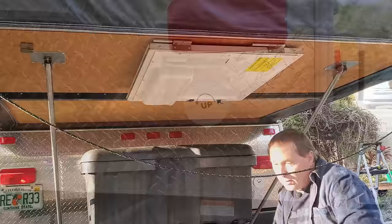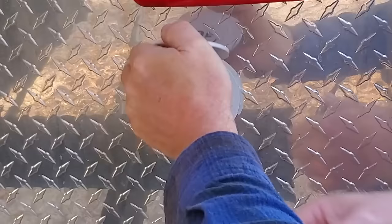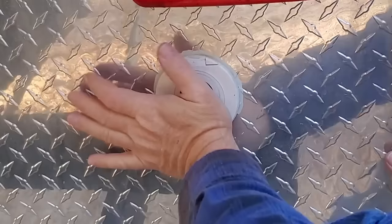So one other thing I wanted to mention, the motorized unit, there's a cap here in the back, which I haven't had off in a while, but you can pop that up. And there's a little insert in there that you can hook a drill onto. It's just got a quarter inch hex head. So you can use a cordless drill to manually run it up and down. If you don't have that, you can even use a ratchet with a quarter inch hex socket on it.